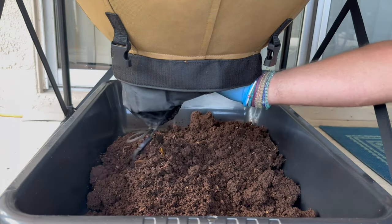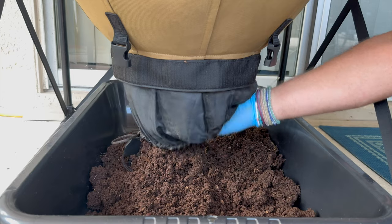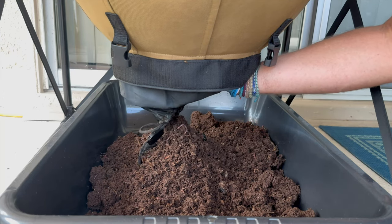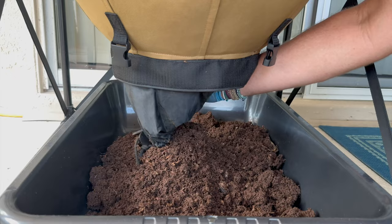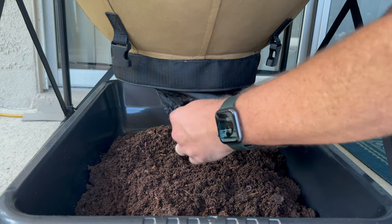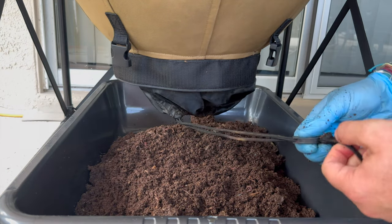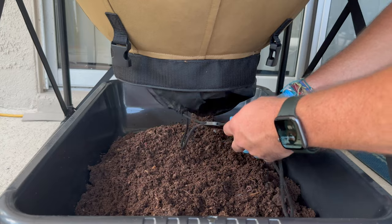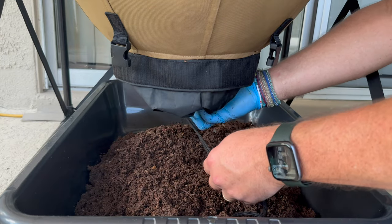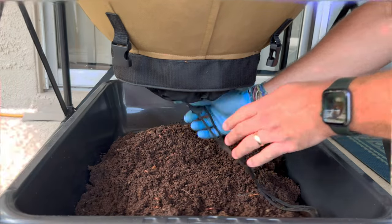We're probably halfway up the mortar tray. I'll get just a little bit more and then close up the bladder and beat it down again so it fills the bottom area back up. We don't want a bridge to form there — thanks to several viewers for that tip. Once I've finished, I'll tighten the strap back up, making sure the hole is no more than about a quarter to half-dollar size, then zip it all the way up and beat it down.